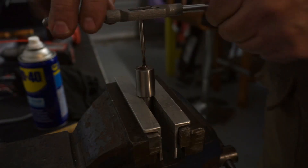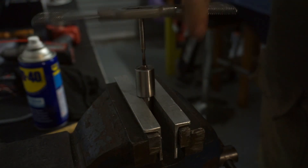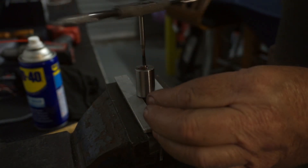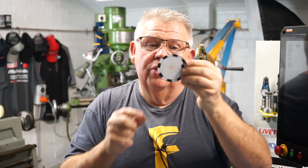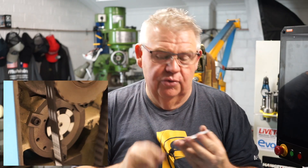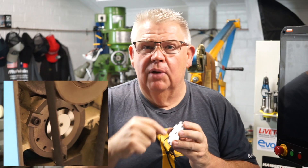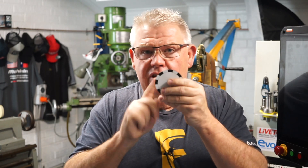On the opposite end of the shaft I drilled and tapped — I kept a 5.5mm boss and drilled and tapped an M4 thread, and that will allow the encoder that I'm making to mount up. This is the encoder wheel — you'll see it's got a small hole in it here which is roughly about five and a half millimetres. This was cut out on our laser at work, and of course when you're cutting plastic with a laser you're going to get a little bit of discrepancy in your diameters, so I made the shaft to fit this wheel.